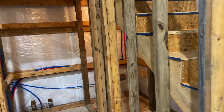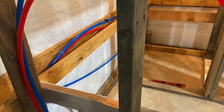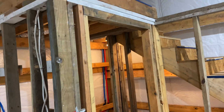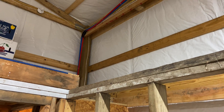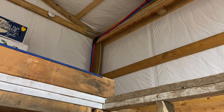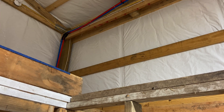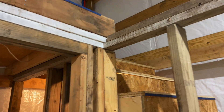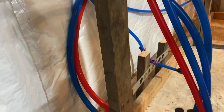So I'm going to show you the bathroom. What we've got is all the PEX stubbed out. You can see in the back — those main trunk lines make the bend down there. I've got some corner braces that form the perfect minimum-radius bend for the pipe, so you can get a nice corner without a fitting using minimal space. Those are fastened into the wood. So it goes down the wall, another 90 along here, and we're finally looping down here and coming into the manifolds.